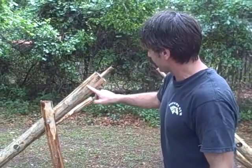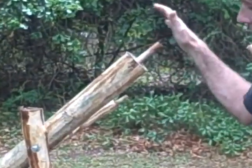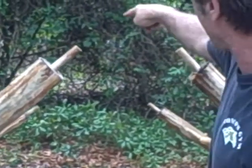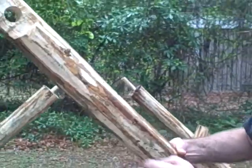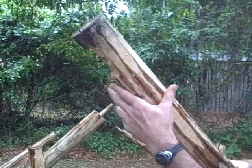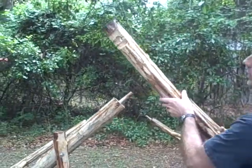I've got an oak dowel through the top — two and a half inches in and glued nice and strong — on all four corners. And I've got this horizontal brace with a hole, and I've mortised it out so that it fits over the top.